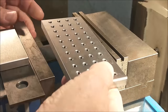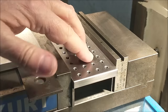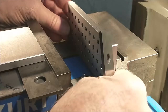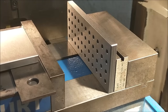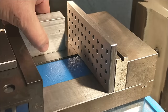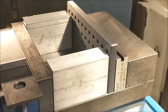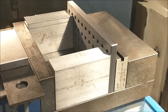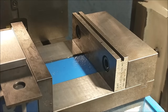One more way to look at how these things are held: if you have a part you need to work on the end or side and it's awkward to hold because once mounted to the plate you can't hold the plate that way without hitting the part — you can, if you use blocks on either end. Use 1-2-3 blocks, sacrificial material, or a strap, then close down on your plate. Now you have a vertical clamping surface, which comes in very handy.